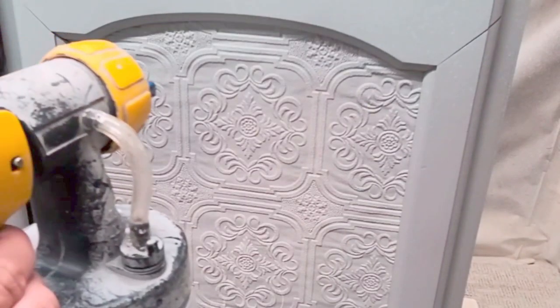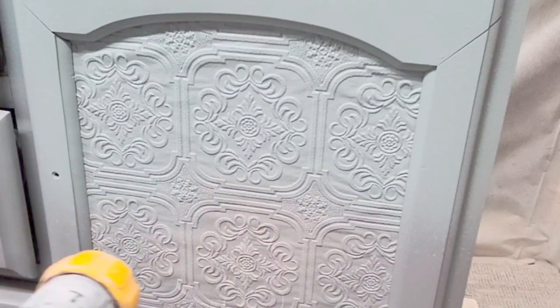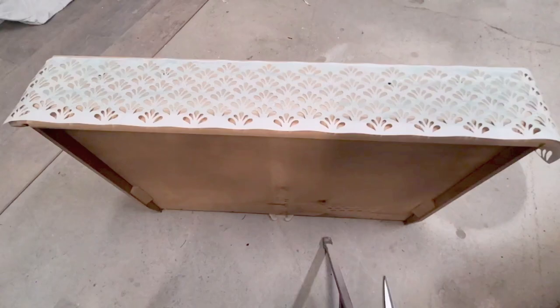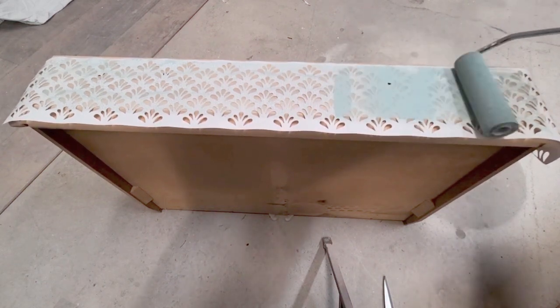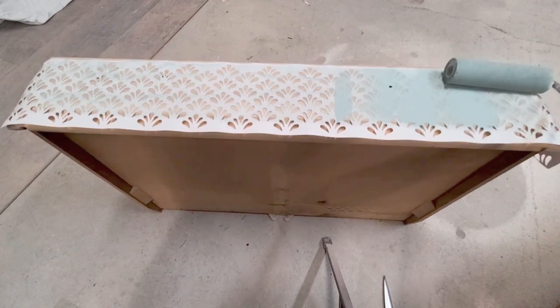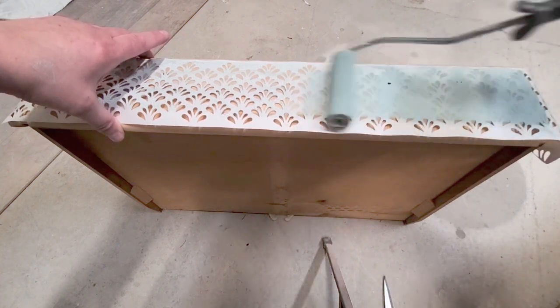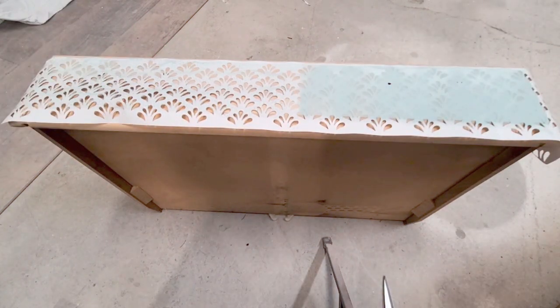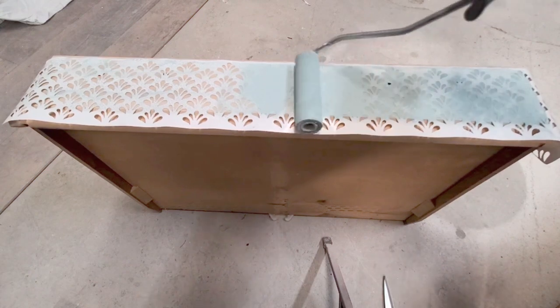Here I'm straining my paint and getting it ready. This is cottage paint called Juniper — it's a very light blue and really pretty. Once my primer was done, I sanded where I could — not on the textured wallpaper — with 220-grit sanding paper. I then sprayed the entire piece with the blue paint, and then applied the fourth texture: a stencil. I used my roller to roll the Juniper paint onto the stencil on just the two top drawers.